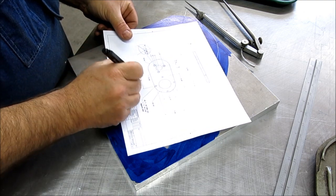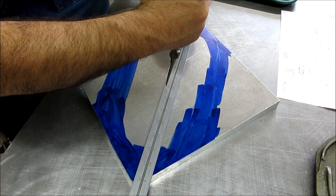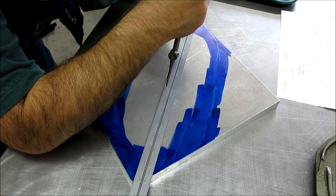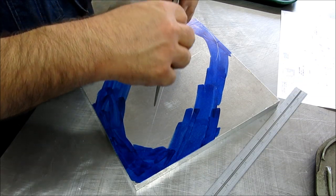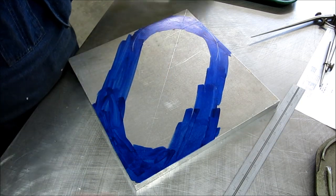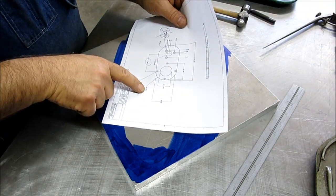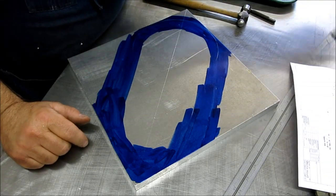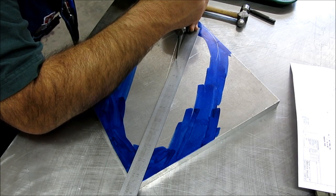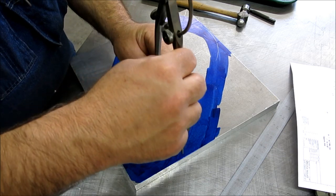Our center distance here is seven inches. I'm burning an inch there just so I have a division to click into. There's seven inches — and from this point here I'm just going to sweep a little spot there. Double check and make sure I didn't make a mistake — yes, that's seven. Get a center pop here. Now we're going to set our second radius, which is 3.3 inches. Cross our fingers — whoa, that's pretty close! I can't believe how close that is.